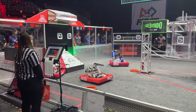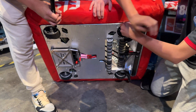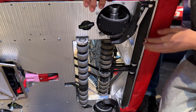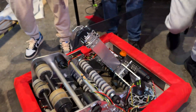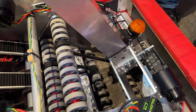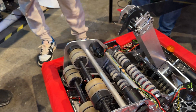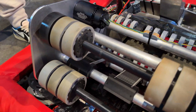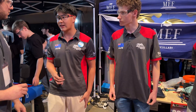What about your intake? So our intake is a very large under-the-bumper intake. The intake feeds through the front here. We've got the first roller here into the intake — flex wheels and some hard wheels that basically bring the notes up into the rest of the robot. To accommodate the larger intake, we had to flip one of the Krakens around to allow for a wider intake, which helps us align better. We wanted our robot to be as minimalistic and simple as possible, and over-the-bumper intakes can often be unreliable or faulty.